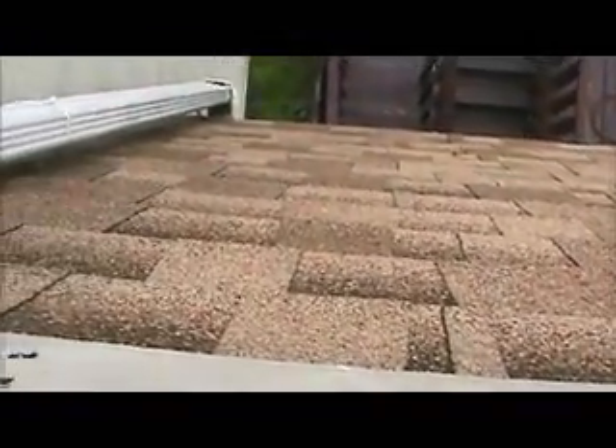This is the mansard in the very back right side. We only need to take the complete shingles off the mansard roof, take this rake wood out and reuse it, get the shingles back on, ice and water shield it, seal it back up, and then seal around this scupper box.